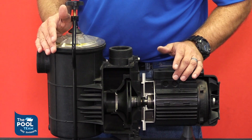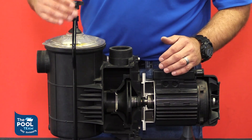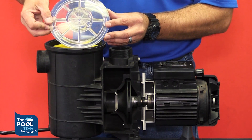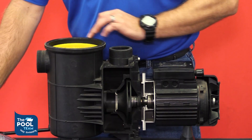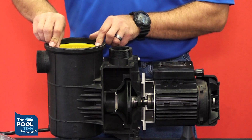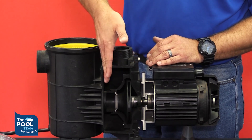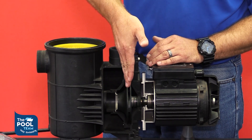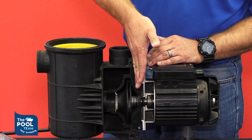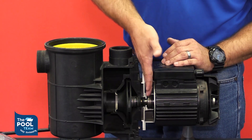This is the pump — this one is specifically cut open so we can see what the inside looks like. On here you've got your pump clamp. If you loosen that one up you will see that you have your pump lid. On top here is your o-ring and your basket on the inside. Moving to the back you've got a diffuser o-ring sitting on your body. You have your diffuser, you have your impeller, you have your flange, and a shaft seal flange o-ring that sits inside the body to seal the water there.